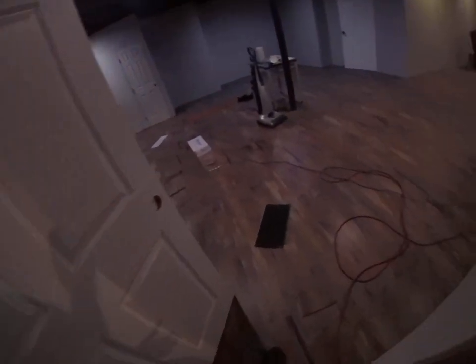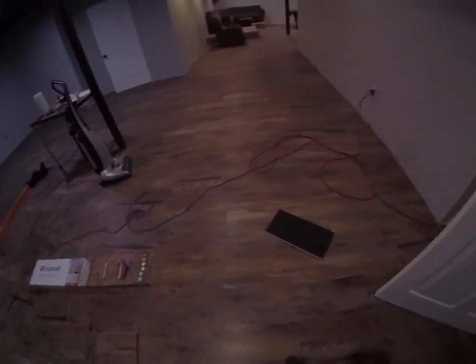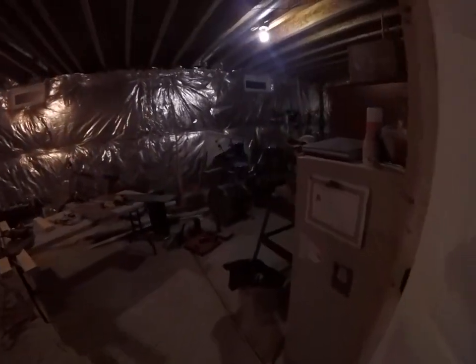I got a miter saw. That's the best way to cut it. You have to flip it over, because on mine it doesn't slide, so it leaves you with like an inch left. But you can flip it over, line the blade up again, and just chop the rest of it. That made it easy. I would not want to do this floor with a utility knife. That's just ridiculous. Oh my gosh, that sounds like a nightmare to me. A jigsaw and the miter saw is what you need.